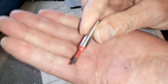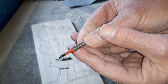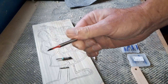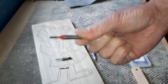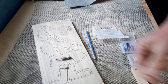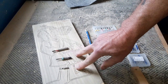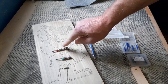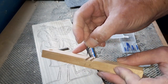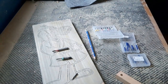It's been a while. Now, when I first started doing projects, I used that on everything. I would do my lines and all the clear out and all my videos from the early days. That's all I ever used, just one piece. Then I stumbled across the CNC bits and the end milling bits. So there's our three bits we're going to use today. We might get away with those first two, but we'll just see how slow and how nicely it's coming out. Okay, we'll set that in the router. We'll set it to 3 millimeters. And then we'll start routing this one out.